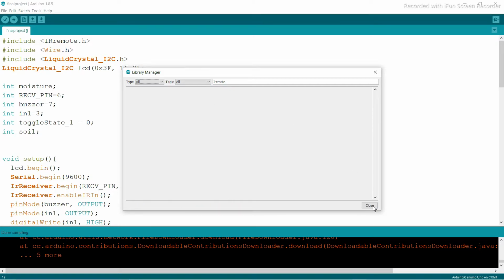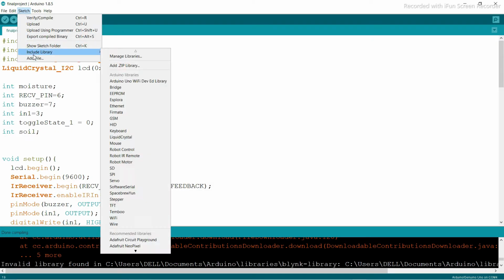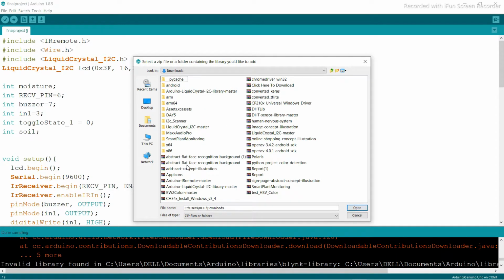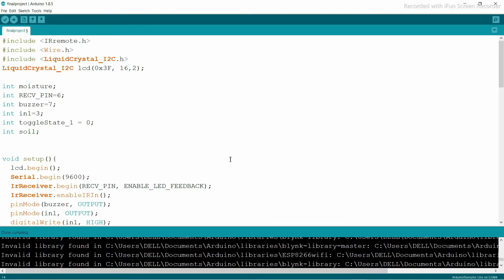You can also install this library online in ZIP format. Just go to Sketch, Include Library, and you can see Add ZIP Library here. Just press on it, go to the downloads, and I download this file. You can see here Arduino IR remote master. So I install this ZIP file from the internet. Don't worry, I will put this code link and also this library link in the description. Just press open and it installs this library on your system. Don't need to worry about that.